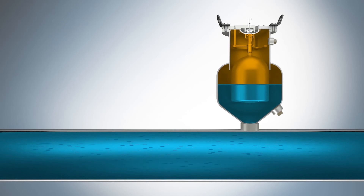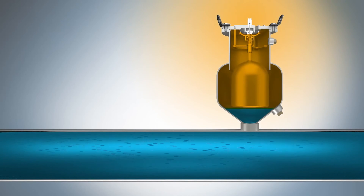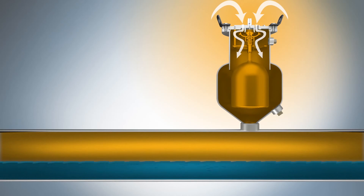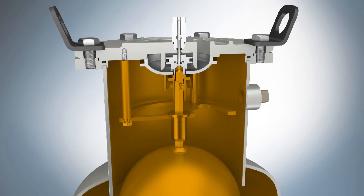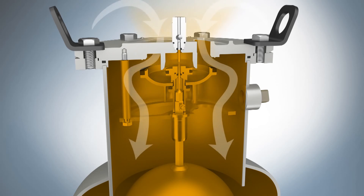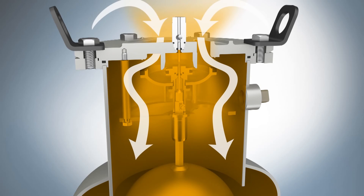When the pipeline is drained or if a sudden break occurs, the valve quickly opens, allowing high volumes of air to enter the pipeline. As fluid level in the valve drops, the float and float shaft move down, which allows the air vacuum disc to drop down, opening the pathway for high volume air to be pulled through the valve, reducing the risk of pipeline collapse due to excessive vacuum.